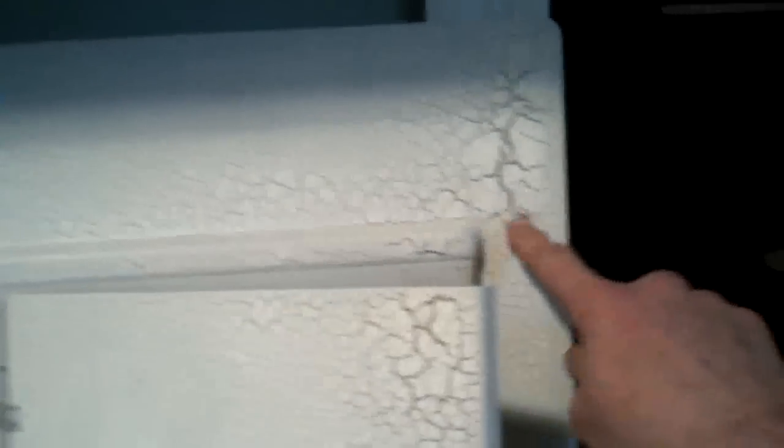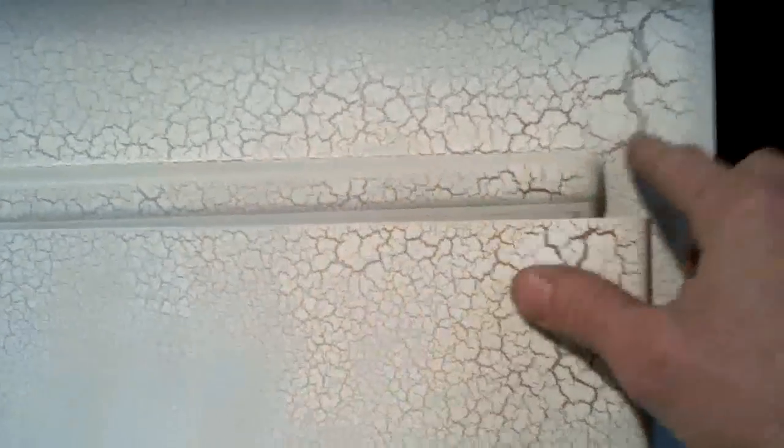Alright, here is the part where you isolate your house from the power grid. Open up your breaker box - there's a series of screws, usually six or eight. Hold the cover with one hand and take the screws out with the other, because when you take that last screw out you don't want it falling and knocking all your breakers off. Pull the cover straight off.